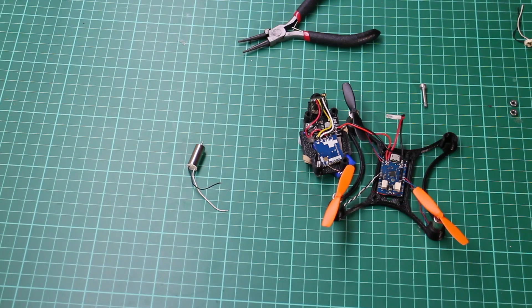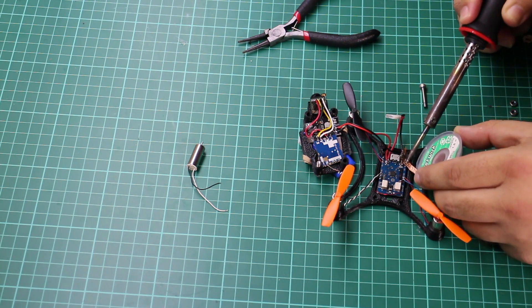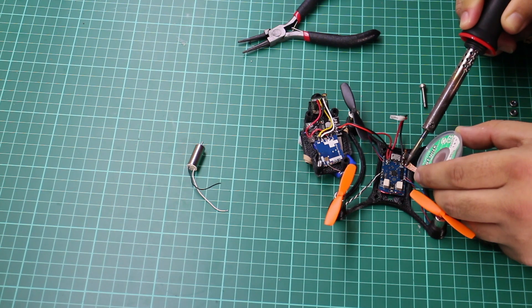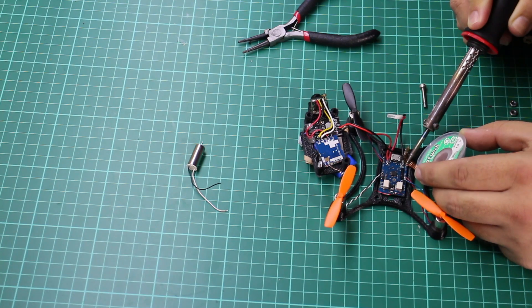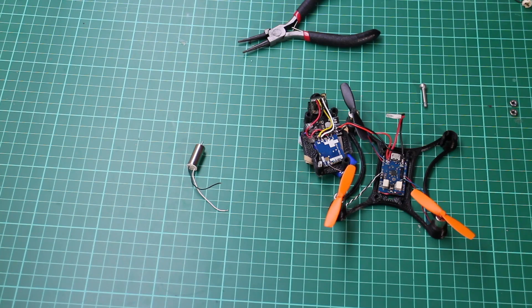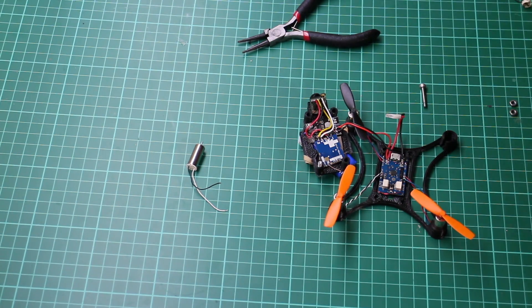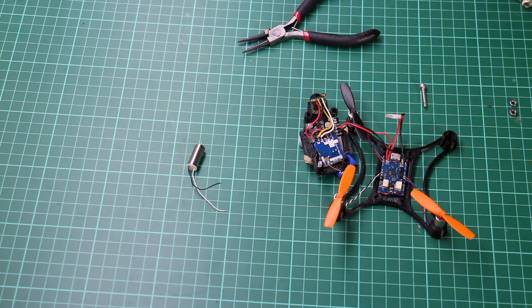It's fairly easy to just dab and remove the solder, but I'm actually going to mop up some of the solder using this little device called solder wick. It's basically a wick for solder — you melt the solder underneath the ribbon and it wicks the solder up into it, leaving the pads fairly clean. It's not removing all the solder, but it's enough so you can add fresh solder for the next cables going on.